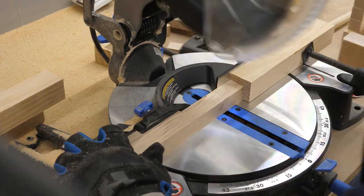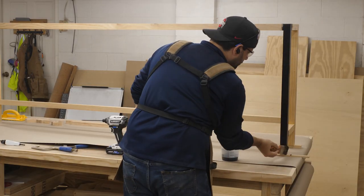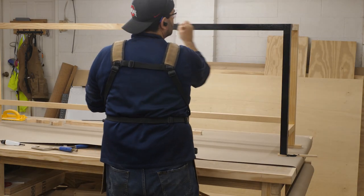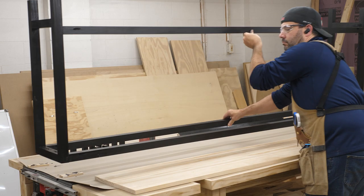I'll be using these for the guard rail that should help keep drinks from sliding off onto the couch. I cut the 1x1s into all the pieces that I needed for the rail. Now that I had my frame and rail pieces, I decided it was a good time to paint. Both of those would be black while the top will be a natural pine that my wife has now made a major feature of our living room.